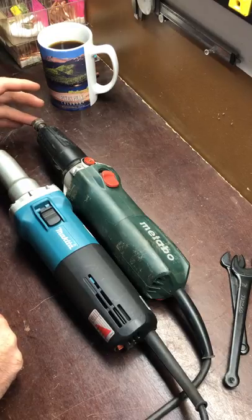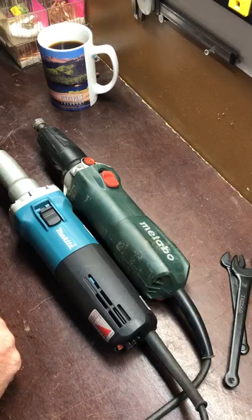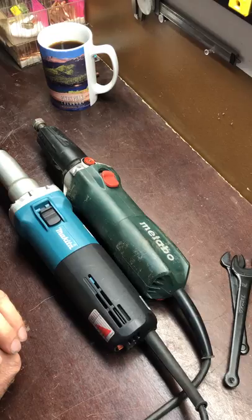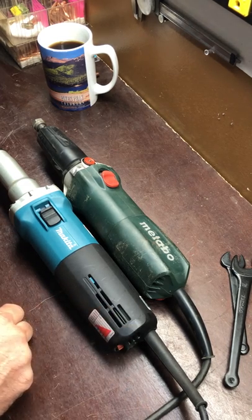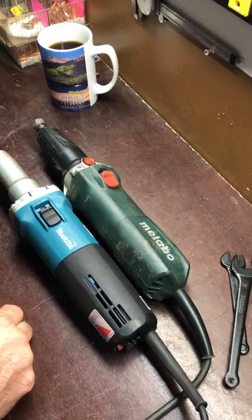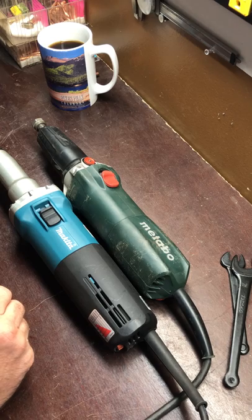I'm going to try and find a wire wheel to stick in one of these so I can use one for grinding and one for wire wheeling. Most plug welds are really hard to get in there and clean out. I scrape them, brush them, and clean them. When I get far enough out I can wire wheel them and get all the stuff off. Then they come out and inspect them — UT, mag flux, all that. We're doing it right because that's how it needs to be done.